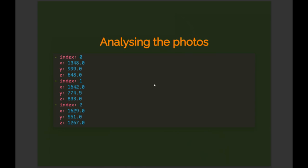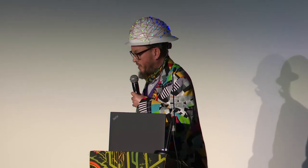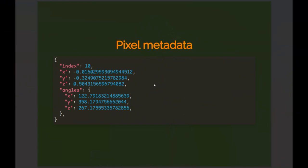Some coordinates are fractional because the rig wasn't very stable. Some lights only had two coordinates — but it turns out that doesn't matter. As long as you've got most of the coordinates, you can stick a BluTag onto the faulty light in the Python console, light up the lights nearest to it, and work out where it is. The scripts were terrible but it mostly worked. We then get metadata mapped in minus-one to one across all three axes, and we can also work out the angle for each pixel using some barely remembered trigonometry.